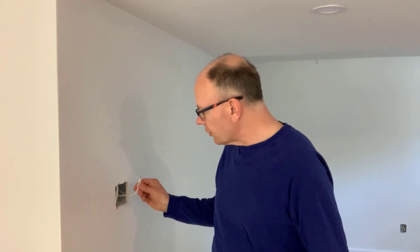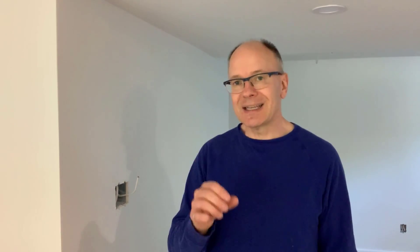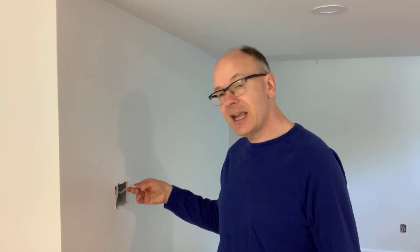Here's the cable right here that goes to our recessed lights — we haven't installed it yet; that's another thing we have to do later today. There's no power coming to this box. If you did have power, what you would want to do is disconnect this wire that goes to your lights from the switch that it's connected to. Make sure you get the black, the white, and the ground — you might have to go into the box because the lights are probably connected back there. You want to get that out so you have this cable going to the lights and you can attach to the black, the white, and the ground.